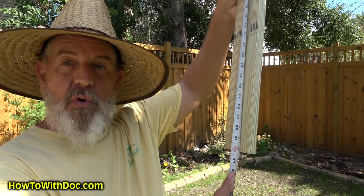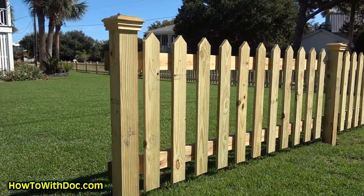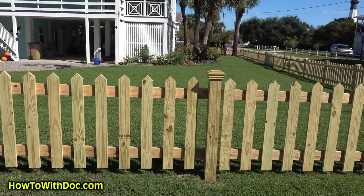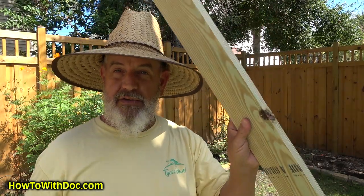You have to check with your city code. We're allowed a 36-inch tall picket fence, so the highest point on this fence is right at 36 inches. Normally for a 36-inch fence, pickets would be cut at 34 inches with a two-inch gap underneath. However, because of city codes and my lawn being a bit taller, I didn't want to block the intersection view, so I had them recut all the pickets down to 32 inches.